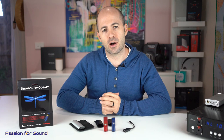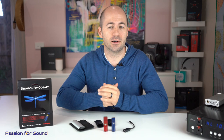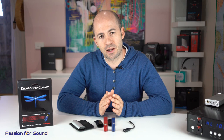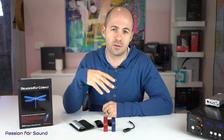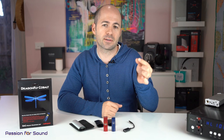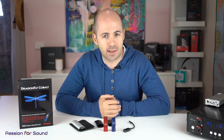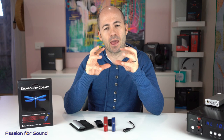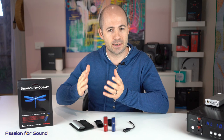The next step is for a DAC like a Dragonfly to do what they call rendering — essentially another unfold of the package. At that stage, what you're starting to get is a high-res file, let's say a 96kHz 24-bit file, from something that arrived to you in the size of a small FLAC or large MP3. There is one final stage called decoding, where the MQA software interfaces with the DAC, recognises it, and does a custom reconstruction of the audio signal. The Dragonfly gives you the second level of unpacking but not all three levels.